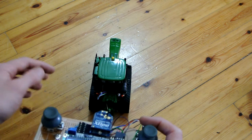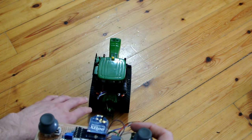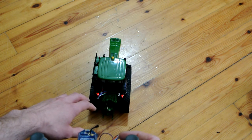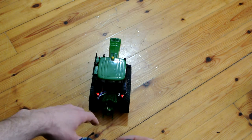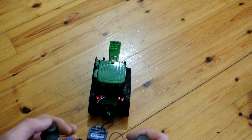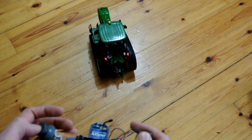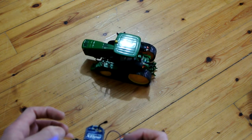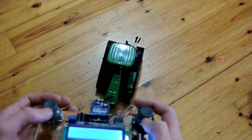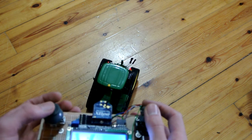Pushing the joystick left slows down one motor — you can see the motor stopping. On camera you're seeing flicker, but there's no flicker for me; that's just the camera's shutter rate interacting with the pulse-width modulation of the LEDs. It looks like the brake lights are blinking, but they're not actually blinking — the camera isn't fast enough to capture the solid picture. That's how our steering works: slow one motor down, speed the other one up, with a steering and a drive control.